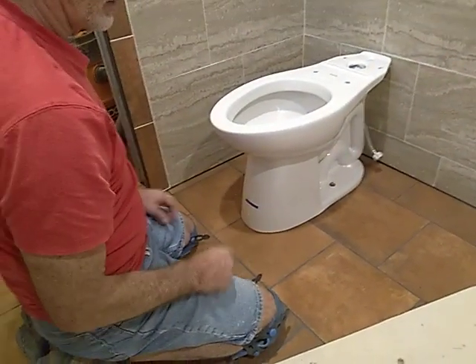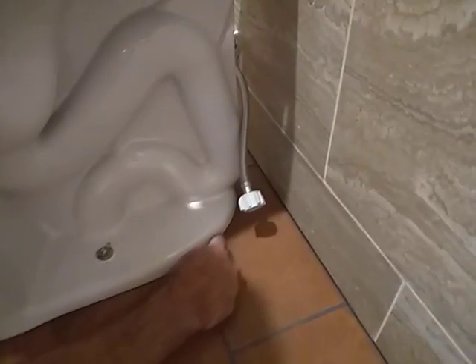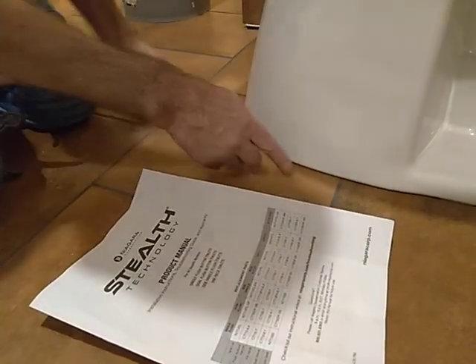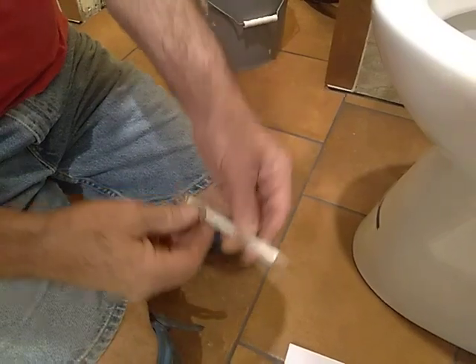Later on, when I'm done here — and it's one of the things that takes probably the most skill — I'll take some caulk, some clear silicone caulk, with the tip cut really small, and I will caulk along here very carefully. Then you have to wipe too. Get yourself a scrap piece of paper — you'll wipe a little, don't let too much build up on your finger, and just keep going like that. Because you want as little as possible in there, but enough — you want it very neat. Even after you've cleaned it away, you might go back one more time, go back the other direction. The key is cutting a small tip on your caulk gun.